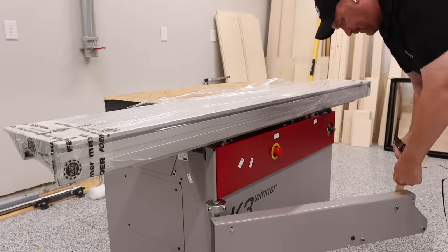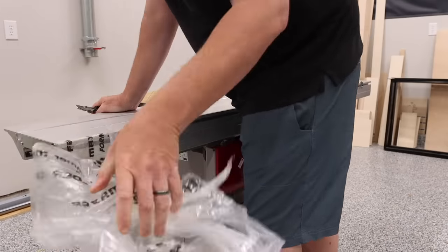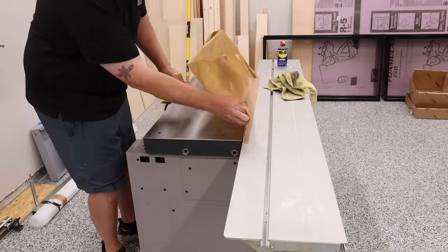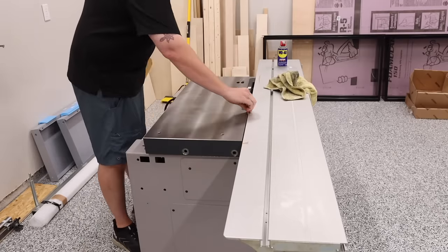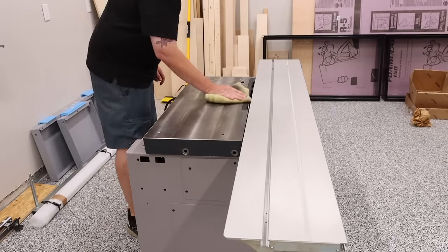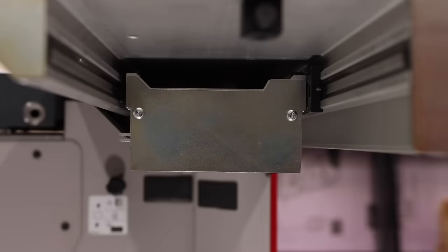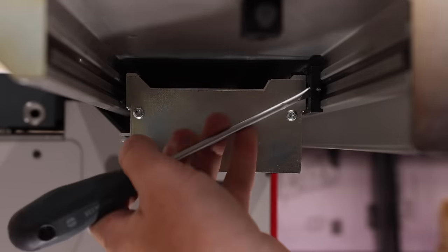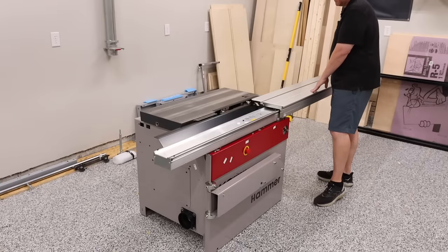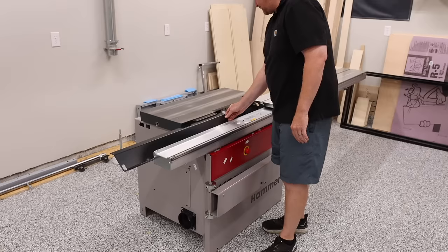After the saw was off the pallet, I was able to break down the remainder of the pallet and all the other materials and get them out of the shop to make space. I used the same pallet jack to move the saw to roughly where it was going to be after I got done assembling everything. From there, I started removing any of the packing grease left over from transport — all I used was WD-40 and a rag. The slider is in a locked position during transport with two black clips. I needed to remove these two locks for the sliding table so I'd be able to access additional parts located inside the saw itself.